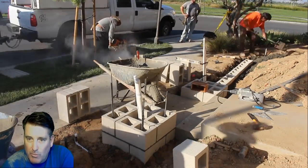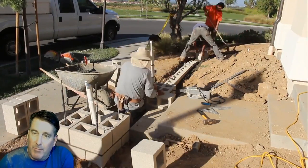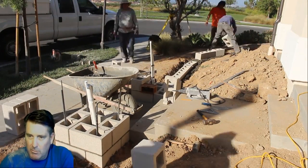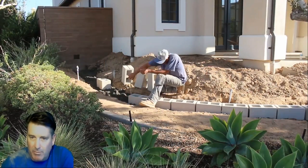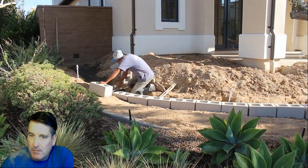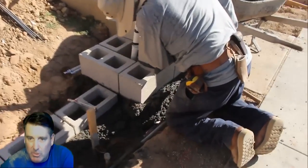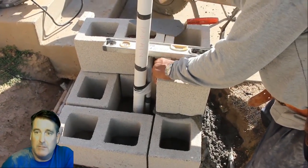Those pipes sticking up in the column — one is irrigation, one is drain — because there's going to be a potted plant sitting on top of the column. These columns will be about six to eight inches higher than the wall itself and will be covered with ledger stone the homeowner selected and will install himself. I will show the poured-in-place concrete cap, also referred to as a decorative bond beam — a horizontal chunk of concrete with steel in it that holds the entire wall together. In this case it's going to be on top of the block as a decorative one.